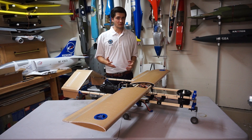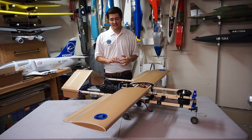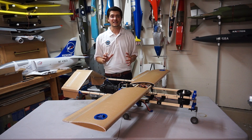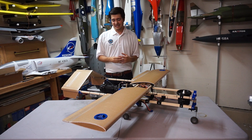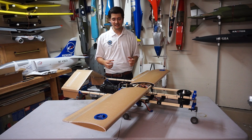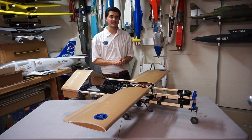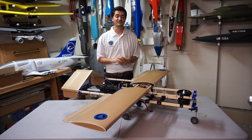These are new gear motors as well. They're exactly the same form factor as previously but they output a little bit more torque at about one and a half times the speed of the original motors. This doesn't really have too big of an effect on performance, but what it does let me do is have faster yaw response so that I can tune the yaw attitude controller a little bit tighter for better yaw control in hover mode.